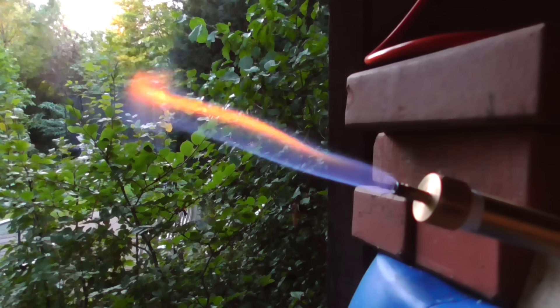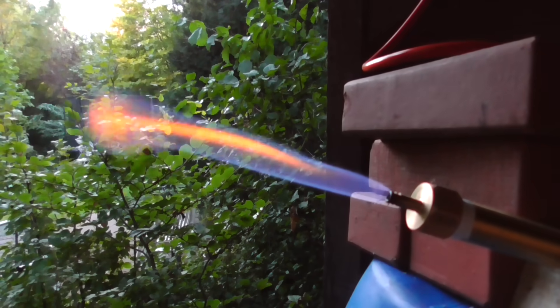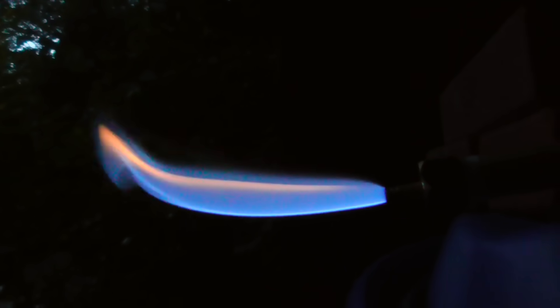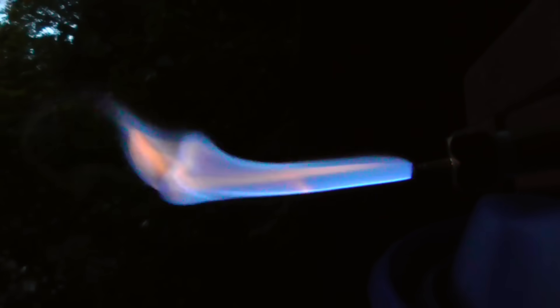Carbon dioxide takes up valuable storage space and reduces combustibility, which is clearly visible in the orange color of the flame. Hydrogen sulfide has an unpleasant smell, is irritating and harmful to health, but above all it is corrosive, which can prove fatal for internal combustion generators.